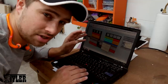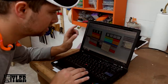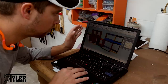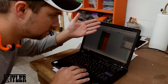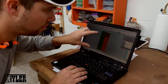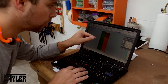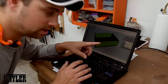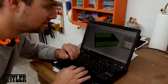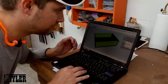Now this is about 10 sheets of three-quarter and five sheets of half-inch plywood, give or take. Hopefully I don't make any mistakes. I got all of the pieces numbered in my SketchUp drawing corresponding to their cut list and how I need to cut that out of a four-by-eight sheet of plywood. I also have all these sheets numbered — the number here corresponds to the number that is part of the assembly. So this drawer is parts one, three, and nineteen, and there's obviously two parts of number one, two parts of number three.